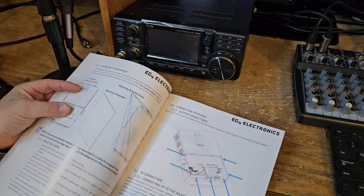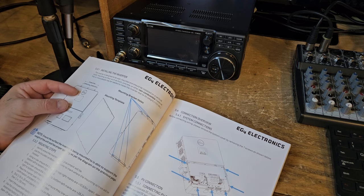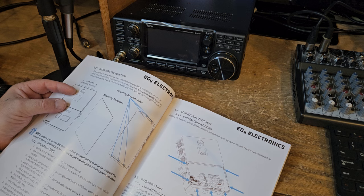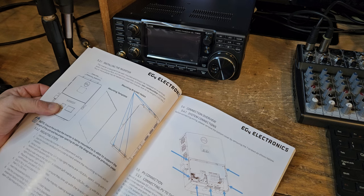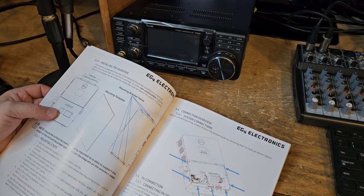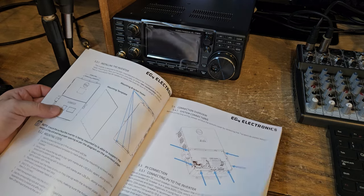Okay. Oh, not to redo mine, though. The recommended DC breaker is a 4-pole, 600-volt, 20-amp, which is the minimum size isolator switch to house both positive and negatives if using two independent strings. Interesting. If using only one string, a 2-pole, 600-volt, 20-amp isolator breaker is recommended. The recommended cable size is 10 gauge, which is what we got. Consult the installer to ensure the appropriate cable sizing is used. Okay.